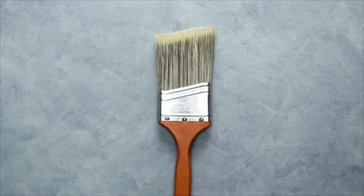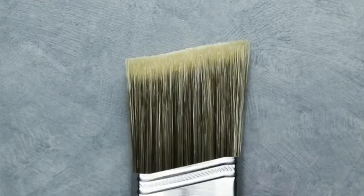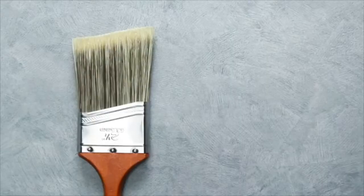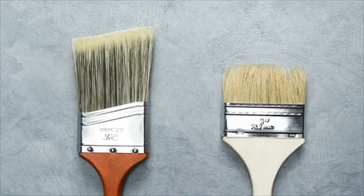You'll also need painter's tape. There are a million different kinds, but I stick to the basics. Honestly, they're all the same. A 3.5-inch angled latex brush. It's about $12 to $15, but it's well worth it and will do a much better job than any cheap brush, which tends to be streaky and make weird textures. It will also hold more paint than a cheap brush, and it makes it easier to cut straight lines, which is super important when you're painting a wall.